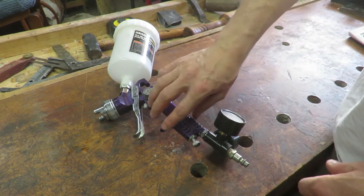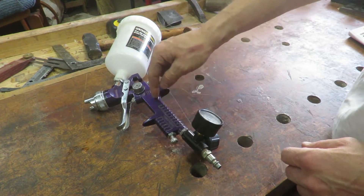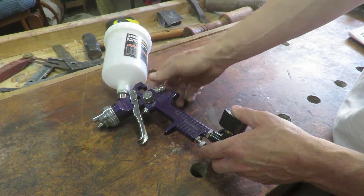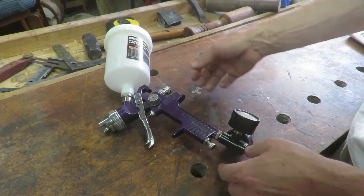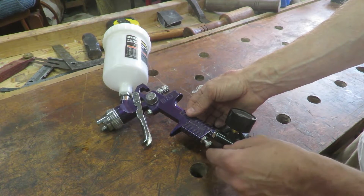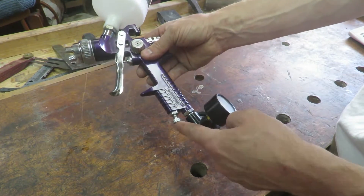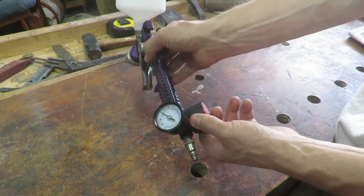Here's your basic gun setup. Here is where the air inlet is and your air regulator that I bought separately — you usually just get the gun itself. You have your flow control right here which controls how much is going out, your nozzle, trigger, flow pattern you can adjust, and then your reservoir. There are also air knobs to adjust air flow, but what I did is open those all the way up and control everything through the regulator knob instead, so I actually know what's flowing into the gun.